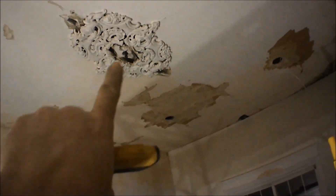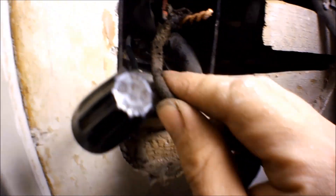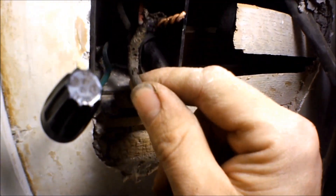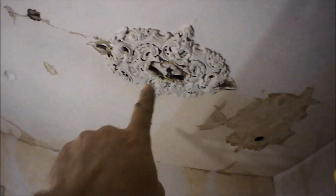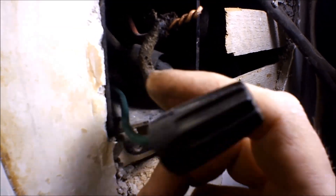For the old wiring that's up in this ornament, I found a wire to it — this little old wire with a red wire in it. I know this wire is the one for that ornament up there because this is the hot that was connected to it. When I disconnect it there's no power up there; when I connect it there's power. On the left side up there there's power — that tells me that's the wire. There used to be a switch here for it, and this is the power in.